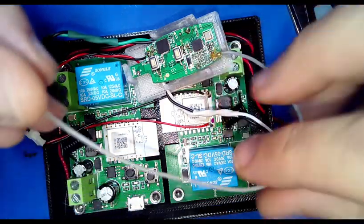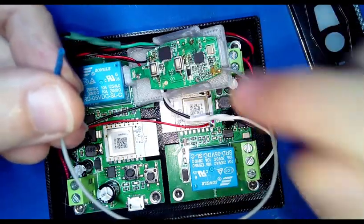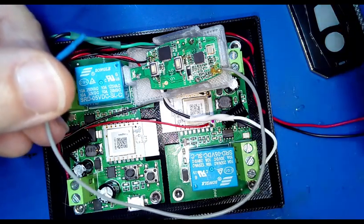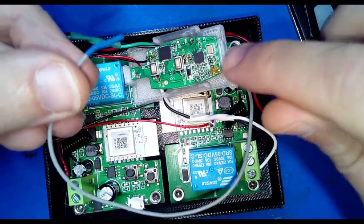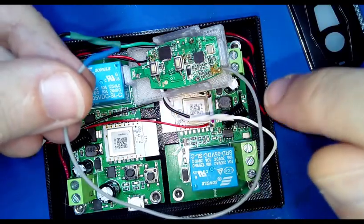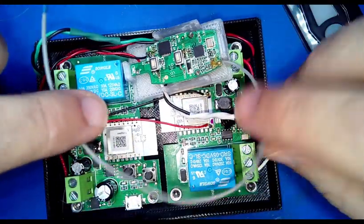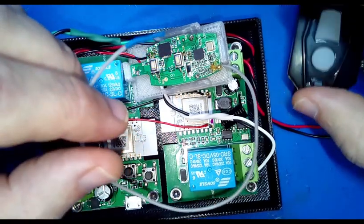And while that's not going to really make or break anything, the ideal is to stick as close to the ideal length as you can, in a quarter or half or full wave or even an eighth, to the transmitter, because that way all of the transmitter's power is getting transmitted out versus losing some of it because you aren't using a correctly tuned antenna. Antennas are a whole art in themselves.